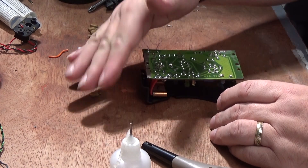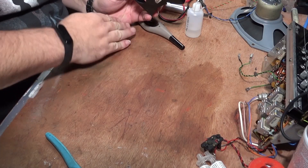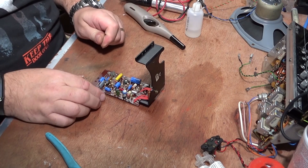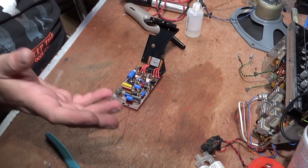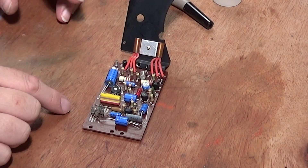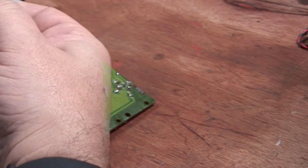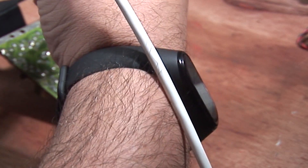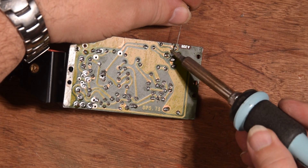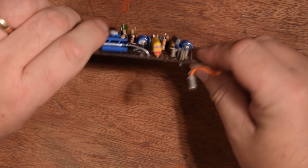So there's the board — clean and tidy. I'm also going to make sure the top of the bench is clean of any lead and wire. Here's the board in position, ready to rock and roll. The instruction manual calls for you to short out the input to ground, so let's find something suitable. It's easier to do it on the back of the board. We might as well use the old transistor — it might as well serve some function in its past life. This is the input pin here, and we need to short that to ground, which is the middle pin.